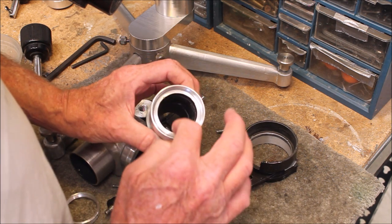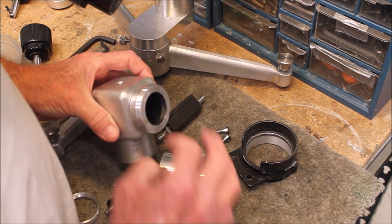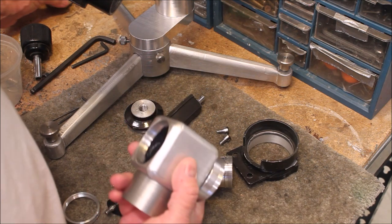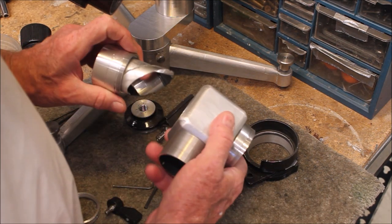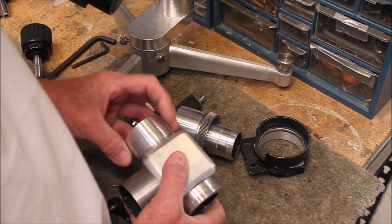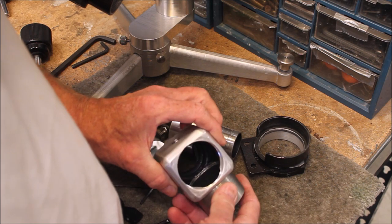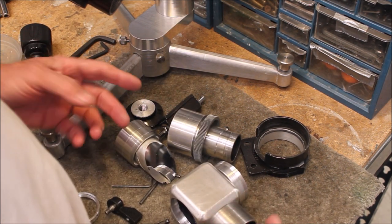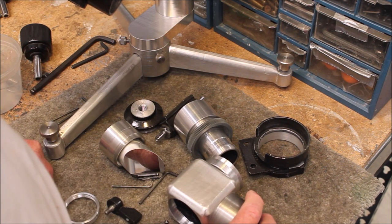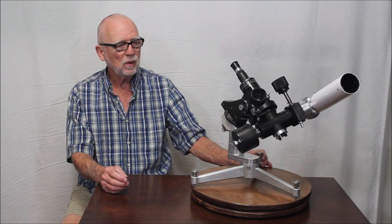You can see there's a nice big hole here, and this is bigger than it needs to be — this is an aperture stop of about roughly an inch-and-a-half. You need a bigger secondary here than an inch-and-a-half because it's not going to hit dead on. One of the problems is that the optics don't always quite line up with everything else. That pretty much gives you a sense of what's going on. One of the problems with these Coudés is that all this stuff is way oversized for a 50mm telescope — the secondary is huge, all the folding mirrors and axes are gigantic. So that's one of the difficulties with this kind of thing. I hope you've enjoyed having a look at this Coudé telescope. Thank you very much for watching.